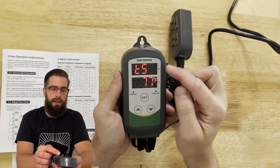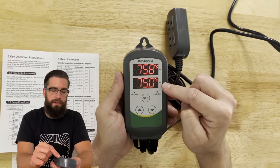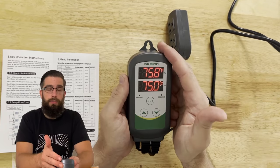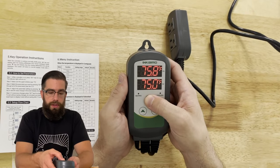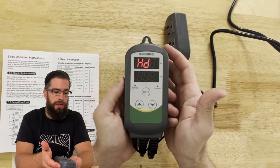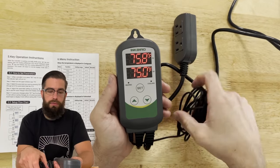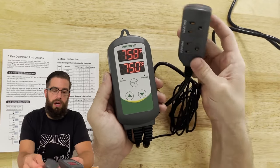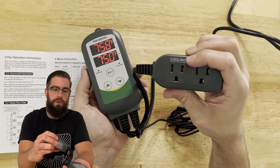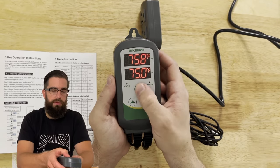We are in the back end now. The next option is the temperature set — let's set it to 75 and program that. Hold it down for three seconds and now you can see the set value is at 75; the temperature gauge is reading 75.8. The next setting is HD, which stands for the heating differential value. If the ambient temperature goes up three degrees, the cooling outlet will turn on — whether it's a wine cooler, AC unit, or some kind of cooling device — to bring it back down to 75 degrees within three degrees Fahrenheit.